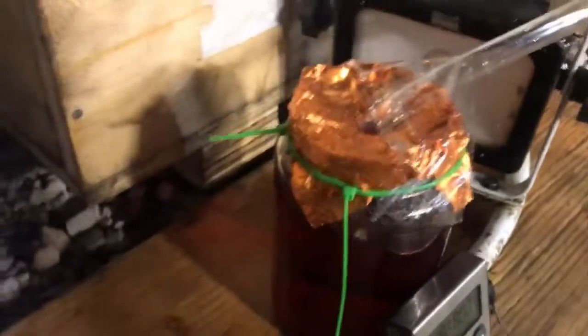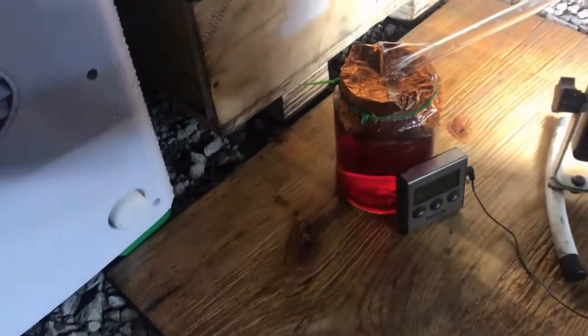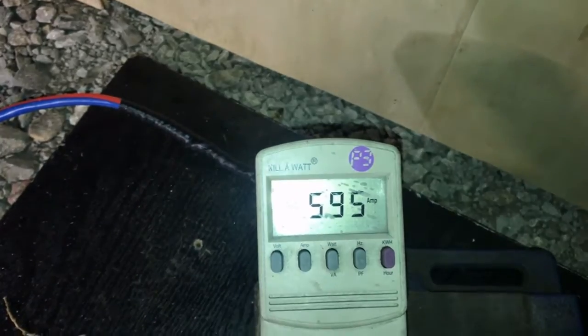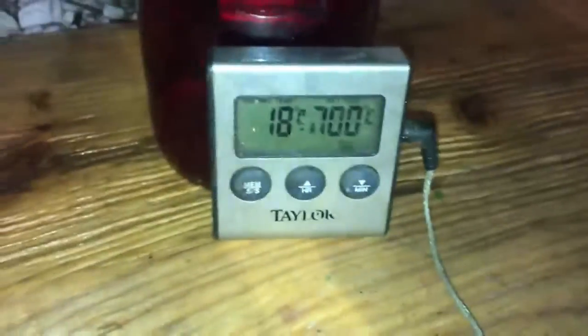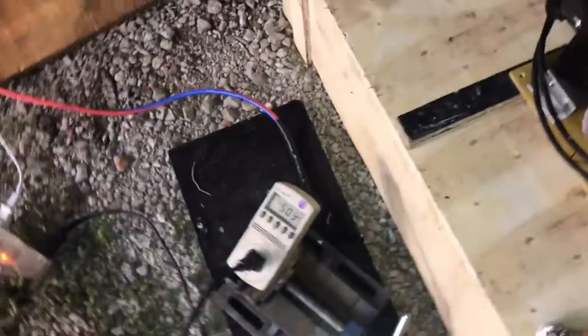I've got thermocouples in place. Last time it took us three hours to oxidize four cc's of red food coloring back into clear water, so let's see how long this takes. I really don't want to blow a quartz tube. We are running with water cooling now and we are heating that water up — we're at 21.7°C out and 18°C in. I need to lower the power; I'm going to hold it at 5 amps just for the sake of safety.